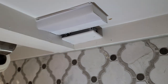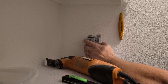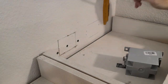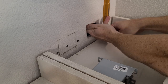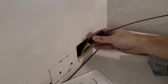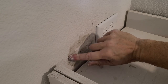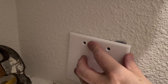For the final outlet, we're now in the pantry behind the refrigerator. This wire here is the one we need to tap into. This was the easiest of the wires to run because it's a non-insulated wall and it was only a run of about six feet. Back in the pantry, I installed a new junction box that connects to the wire I had to cut and the wire that I ran up to that new outlet.